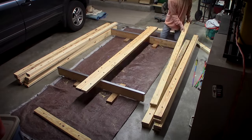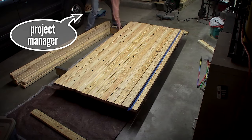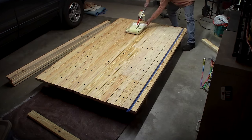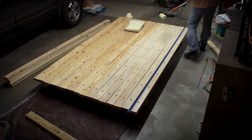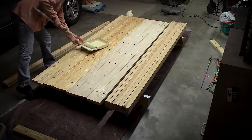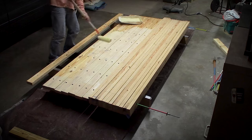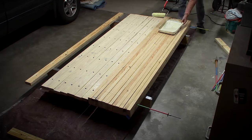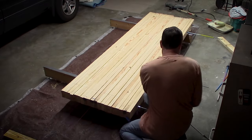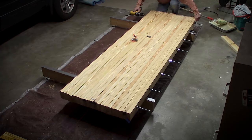I'm adding a little duct tape to the top of the risers that I'm going to be using to glue on. This is just to help keep any squeeze out from bonding the top to those panels. I'm using a 3/8 inch paint roller to apply Titebond and just slathering it on, trying to get plenty in there, stacking up the pieces, squeezing them together as I push them into place, and putting the threaded rods through the holes. And of course, you have to give it a little persuasion, tap it with a hammer here and there, but overall it went really well.